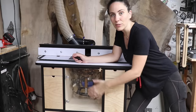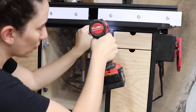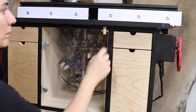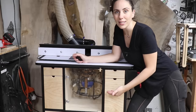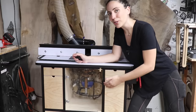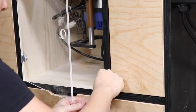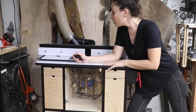I had a few little issues towards the end — the acrylic wasn't staying closed so I took a little piece of scrap, drilled a hole into it, and it's being held in place with a screw. When I leave it down it keeps the door closed and I can lift it up and open the door if I need to. I thought the dust collector was going to be strong enough to pull the plexiglass in and keep it closed, and I was right, but it was pulling just a little too much at the bottom where I didn't put a stopper piece. So I added a little stopper piece and now the door stays closed in the correct position whether the dust collector is on or off.